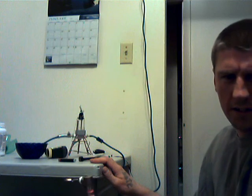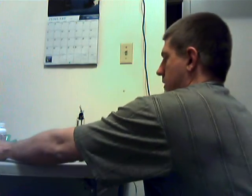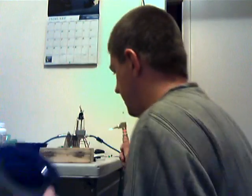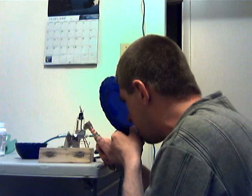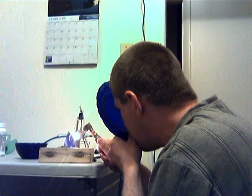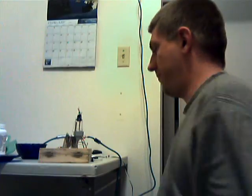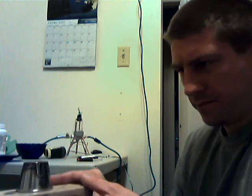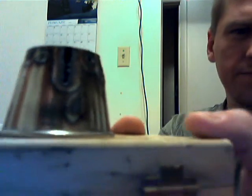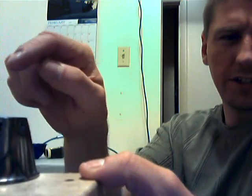That's a 100-amp flame right there — squirting water out like crazy. If you're going to be cutting metal with this, use some kind of eye protection. I see people on the internet injuring themselves by cutting holes. As you can see, that thing's blasting right through there pretty good at 100 amps. Here are the holes — that thing burns right in there. The weld is pretty brittle; on the edge it's so brittle that I don't see this as being practical in any way.